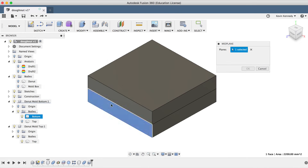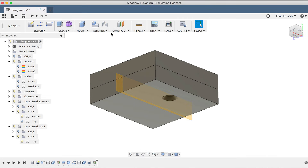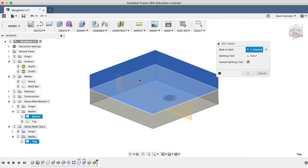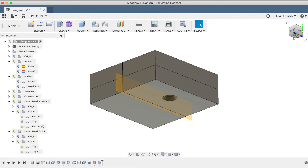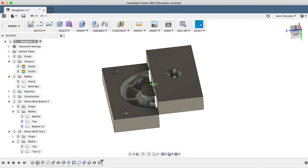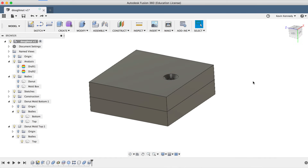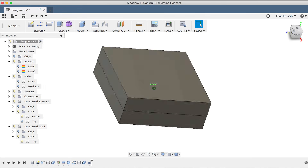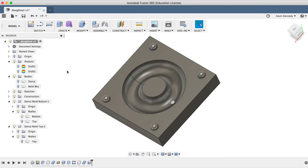This is something you have to play around with. A complex 3D printed mold may work well if you pour something flexible such as silicone, and may not work as well with a hard material such as resin. You can always cut up your mold into more pieces, allowing you to remove any type of material out of the mold. To cut further, you'd simply follow the same steps to create a construction plane and use the Split Body tool. You could also add extra registration keys to the sides of each mold part. Keep in mind that although more pieces may make it easier to pop an object out of the mold, you'll likely end up with more parting lines where the mold boxes meet, so you'll have to plan ahead.